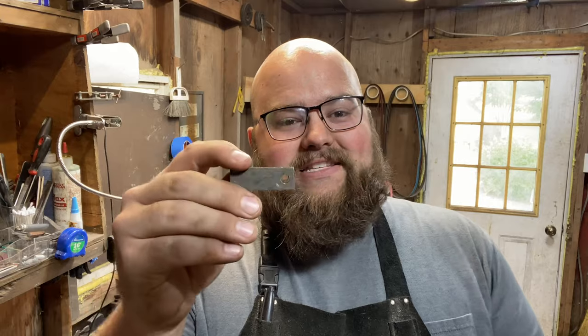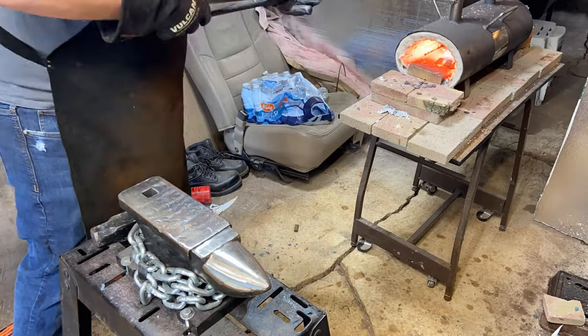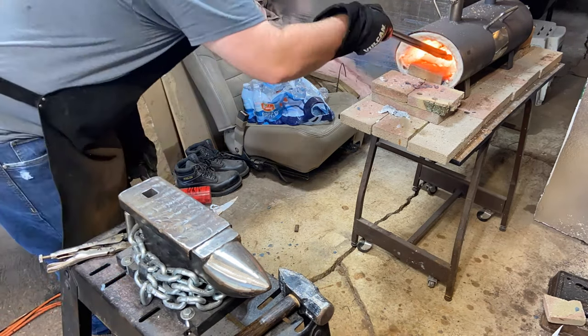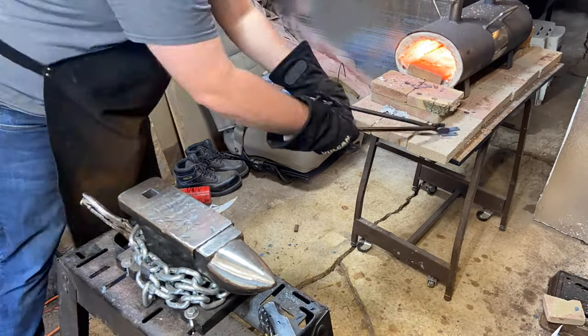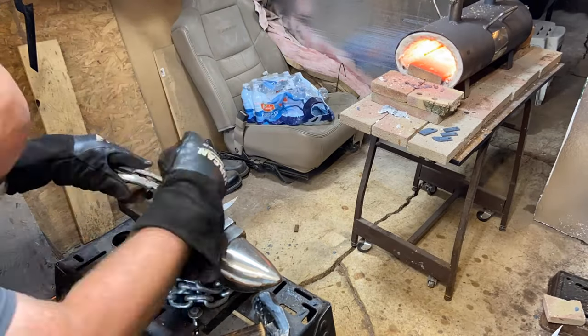I'm going to go ahead and move on to the next step, which is to stamp in my maker's mark into the face of them. So I'm going to go ahead and light up the forge. Hot stamping the maker's mark is always a process that worries me a lot because there's no good way to fix a bad mistake — you have to make sure that your stamp is lined up absolutely perfectly and that you hit it perfectly square. Please subscribe to this channel, it would help my small business a lot. If you hit like and leave a comment, I would really appreciate every single one. Thank you, guys.